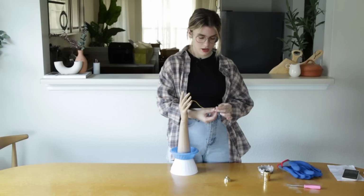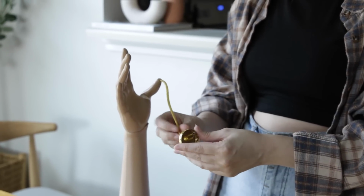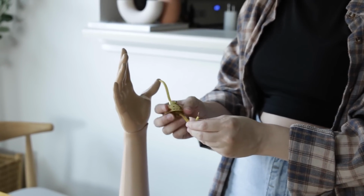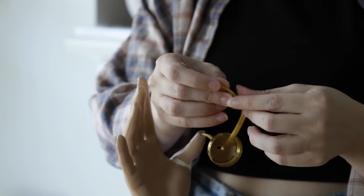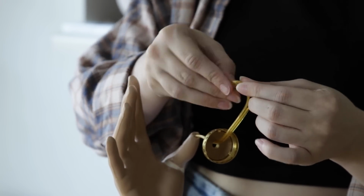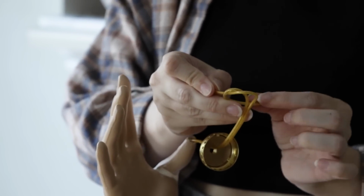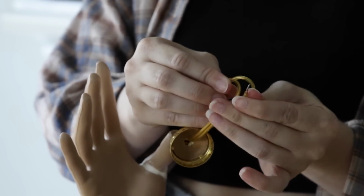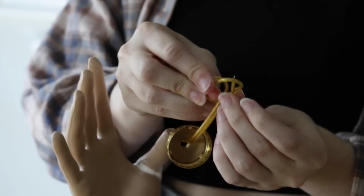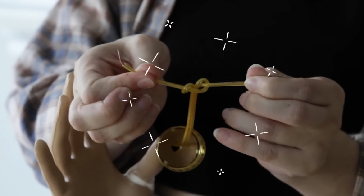What could go wrong? First thing you gotta do is separate your wires. Actually, I shouldn't have done that first. Then remember that you should have already put the cap on and just string that on real quick. Next, it's time to do an underwriter's knot. So let me attempt to walk you through it. Okay, we're gonna take this wire, we're gonna put it back here. We're gonna take this wire, put it around. Now, come with that same wire you just used. Come around the back and up. You did it! You're a professional sailor!